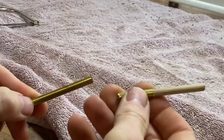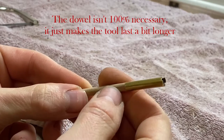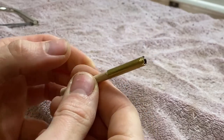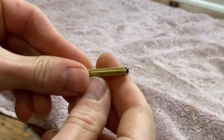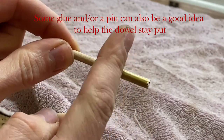I've cut off the excess - this was all attached before. I've attached a wooden dowel to the back side of this, the side without the cutting edge. This is for the drill chuck to hold onto, because if you clamp the drill chuck directly onto the brass pipe, you can end up distorting it and changing its shape. So I've just hammered in this dowel here, and the chuck will clamp onto that instead without distorting the cutter.